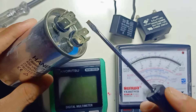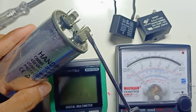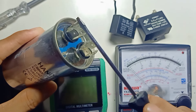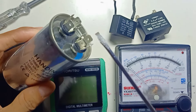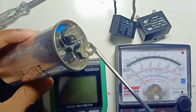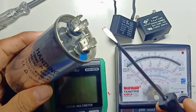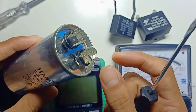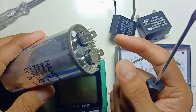You also have to check the pins. Some capacitors will only have two pins — one on each side. Some capacitors will have only two wires. I have four pins on this side and four on the other side, but in the end there is only one pin joined on the inside. So no matter how many pins come off from each side, in the end it is only two connections. You can use one wire from this side and one wire from the other side. The extra pins are optional, depending on how many wires you need to connect.